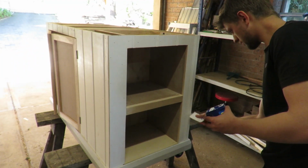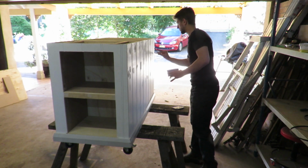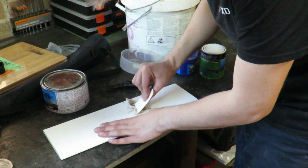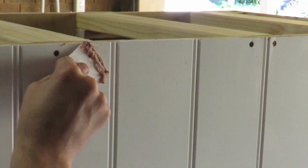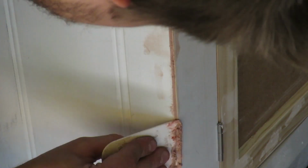Now I'm preparing for painting by filling all the small holes with spack filler. Spack filler seems to shrink when you fill larger spaces with it, so I'm using builder's bog here to patch these holes. It's a 2-part mixture and it sets rock hard. I like making painted furniture because you can hide most of the mistakes that you've done with just some filler and sanding.